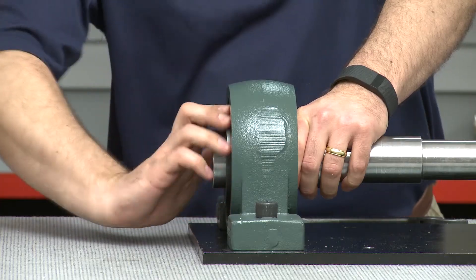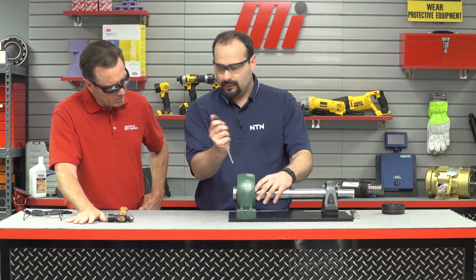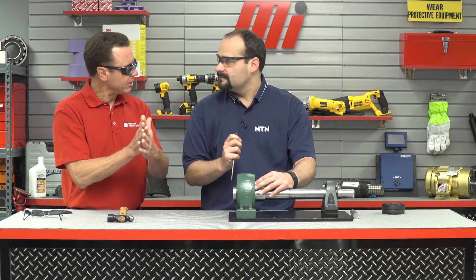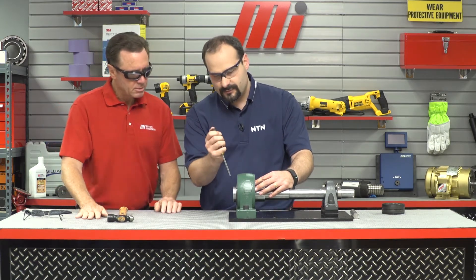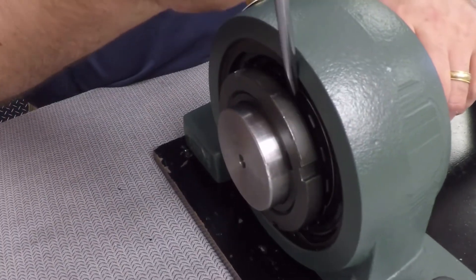Back off a little, then take a wedge or a screwdriver and pull that sleeve all the way into the bearing so it's nice and tight — we want to make that flush too. When you're doing this, do not damage the seal. Bring it in nice and tight.